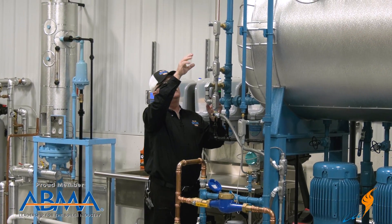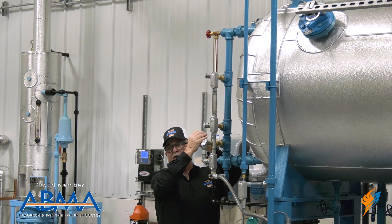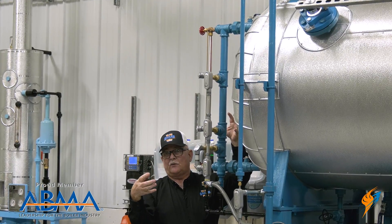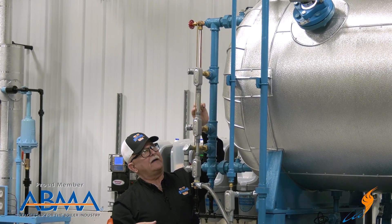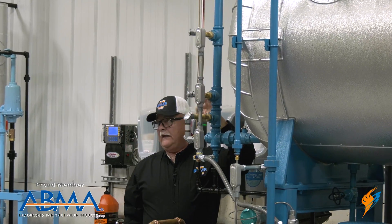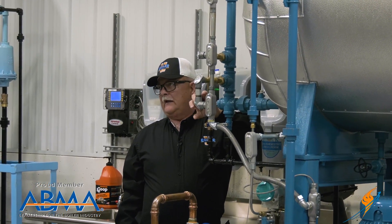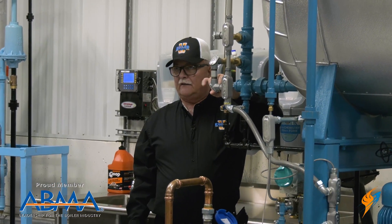Where I'm going to have steam, the steam will go out on that pipe and it'll condense — because it's not insulated. The steam will condense, the water will fall back down into here, so that'll give me a level reading even though it's not a true level, because this isn't open. That's what we were talking about in there.